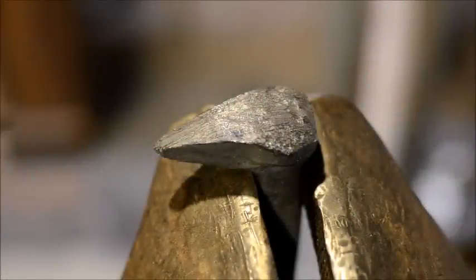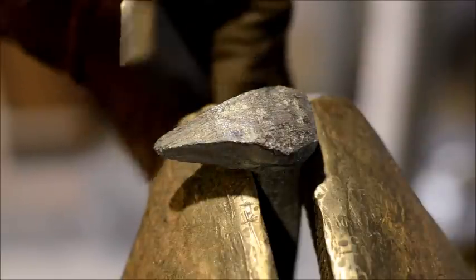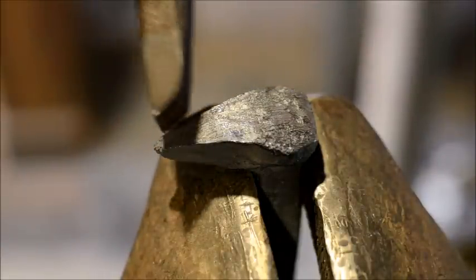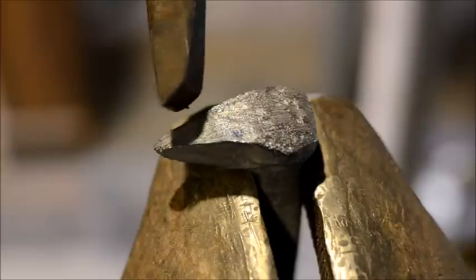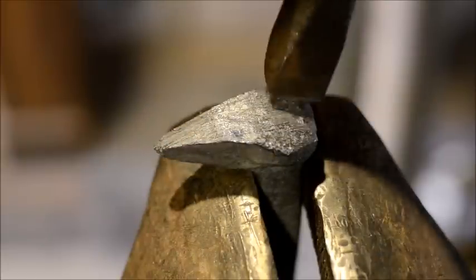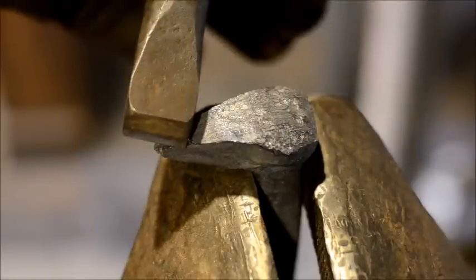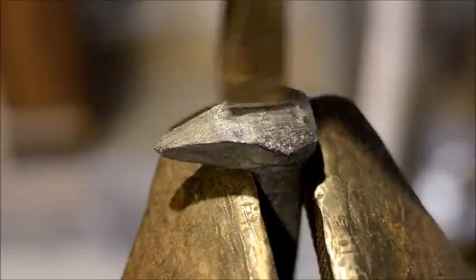Okay, ladies and gents, here we are at the vise. So, what I'm going to do now is take these butcher tools. See if I can get a side profile here for you. Essentially just a leading edge. Anything that's got a taper with a leading edge is considered a butcher and chasing. And I'm going to chase a center line down from both sides.